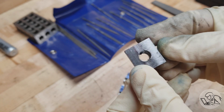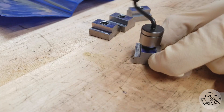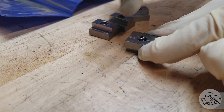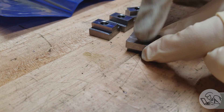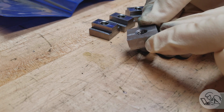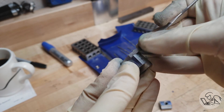At this point, if you have a chamfering tool suitable for these holes, it would be good to do that operation on all four T-nuts now. I don't have one that will fit the mill and be the right size, so I'm going to deburr these guys by hand over on the bench. I'll use a Noga tool to deburr the holes — there are links to buy this tool in the description. Then we have a lot of tiny edges to deburr, so I'll break out the needle files and spend some quality zen time filing.